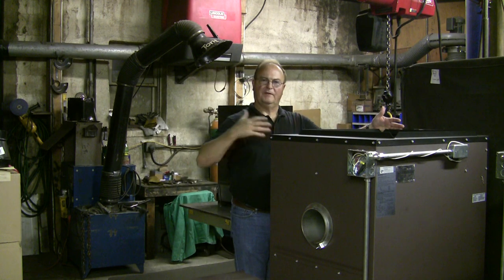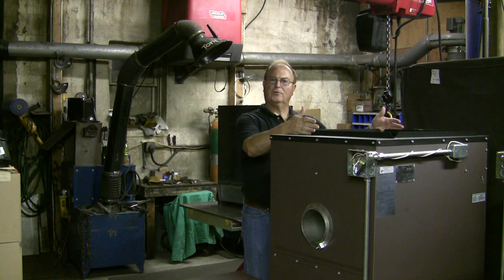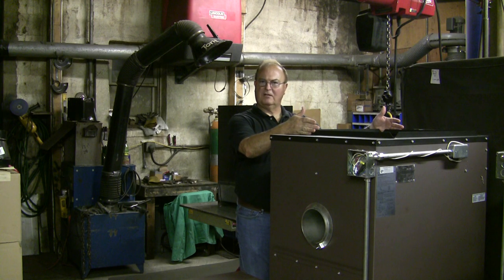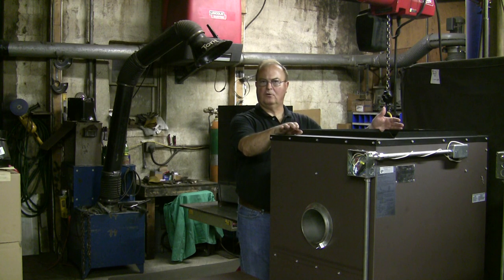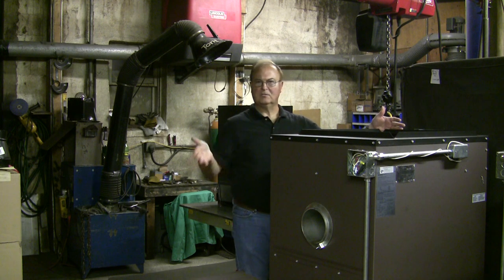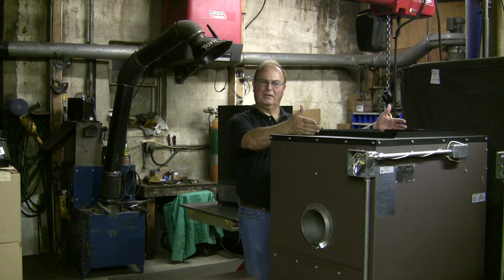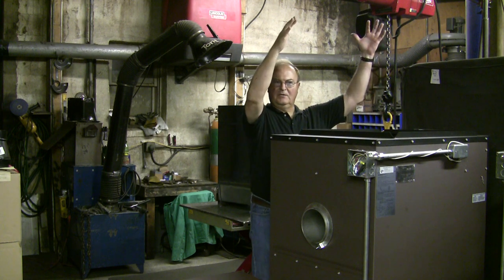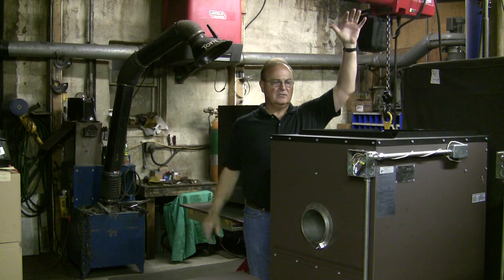And you professionals, you will probably make yours up yourself. If you're a homeowner or you're a do-it-yourselfer, I've noticed that you can get them right off the shelf at Home Depot, Menards, probably Lowe's, but a lot of the home goods stores have ready-made 24-inch plenums. They would get attached up here, and your plenum goes up and connects to your ducting to your house.